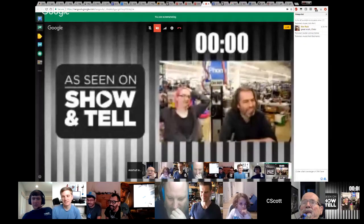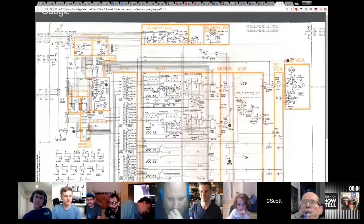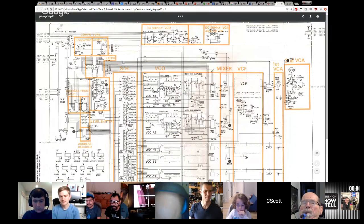There. I was talking about working on an old machine again and making new voice boards. Well, Roland has this habit of using the hardest to find parts ever. So I'm not even going to try. This is a schematic of a Roland Jupiter 6 voice board, and what they did is they put 4 voice circuits on each one, but since it's a 6 voice, they left half of them off of one of the 2 boards. Well, right away we have a little problem here.